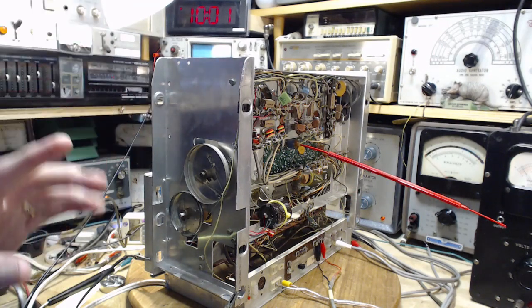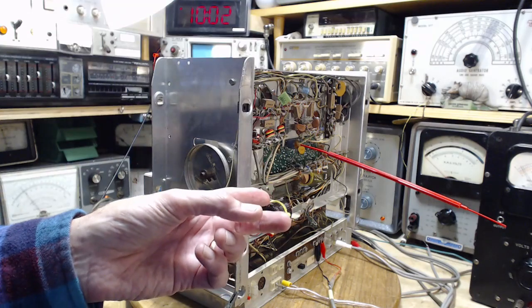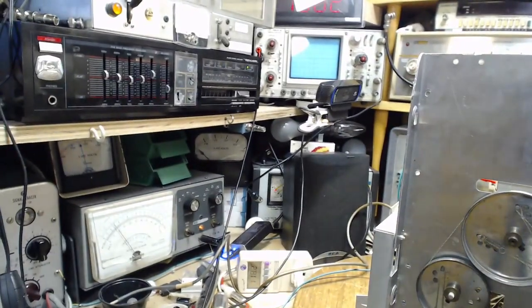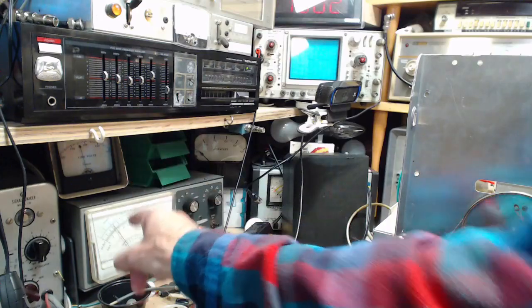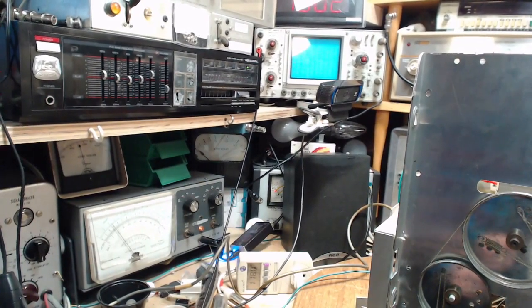So right now there should be no 67 kilohertz signal coming through. I'm going to flip my generator so it sends a 67. I'm not going to retune anything. Watch this meter. I gotta do it this way. There's only so much room in here for the camera and me. Okay, so we're going to flip it. Now that didn't change one bit. This did not change one bit. Yes, chances are this trap is set right.